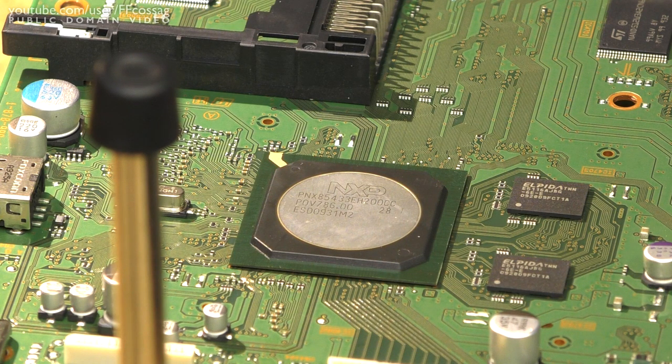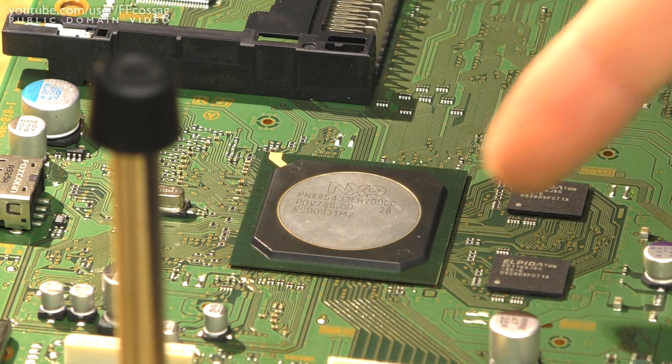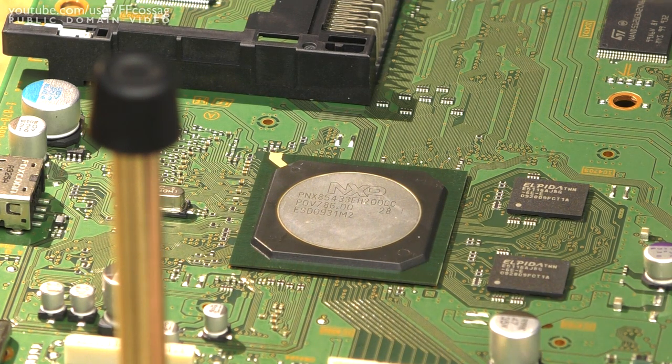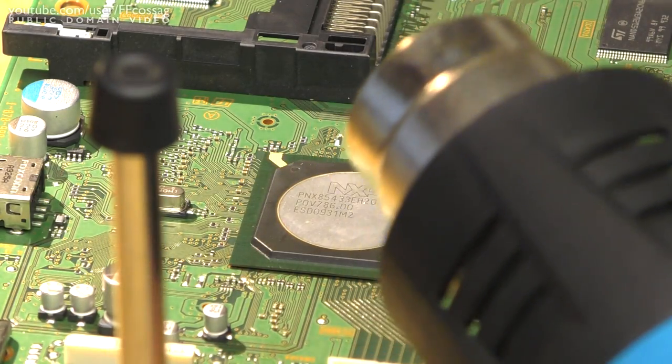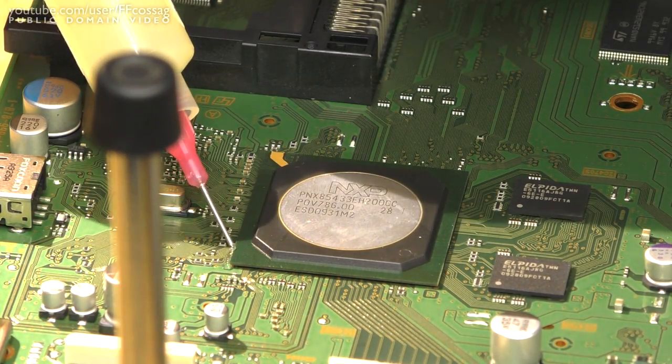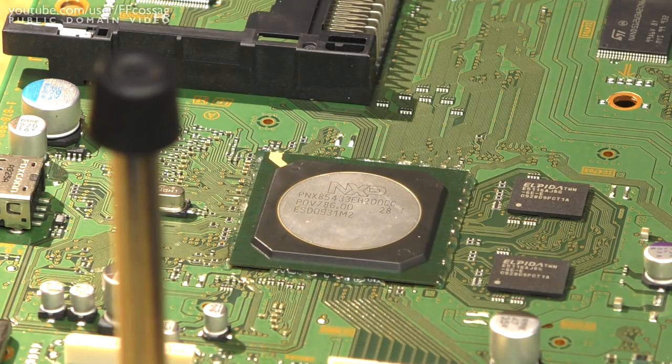The reason I'm giving this lecture is because I don't want to be branded as one of those guys that just goes, 'Oh it's the BGA, that's the fault, the BGA is bad because it's the BGA, and BGA solder joints you can't see so they must be bad.' I would rather say that I have gone through a relatively rigid process of eliminating other factors which should cause this set to malfunction. So on we go. I've brought out the big guns for preheating the board. Let's just get a bit of flux around here, quite a lot of it actually. Let's heat up the board.